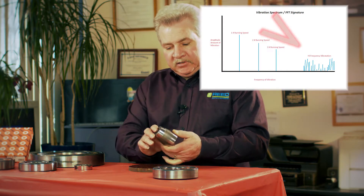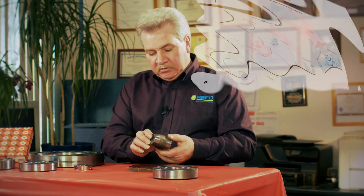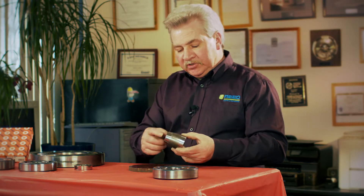If you were using a bearing analyzer, you would see a floor trash level way out in the middle of the spectrum, somewhere around 1500 Hz. You can see all the shaft current problems showing up.